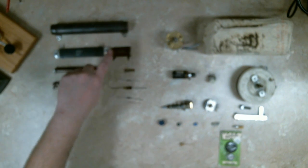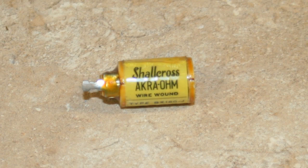These here are all wire wound. A high-precision wire wound resistor has an accuracy of 0.5%. This would be used in audio and RF attenuators and anywhere you need very accurate control of the signal level entering a circuit.